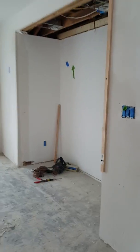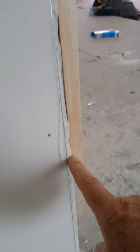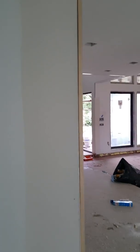Here's another place where we've put the wood strip up and he's preparing to mud it. You can see the edge right there — there's just nothing right here that's flush. The idea on this one is that this corner is so crooked and wavy that we have to put a straight edge there just to kind of get it where it'll be flat again.